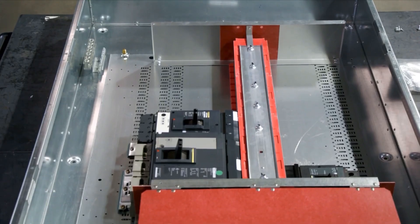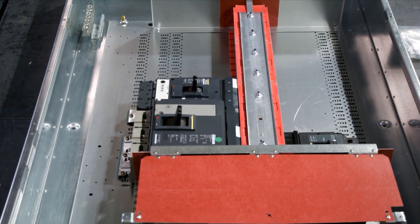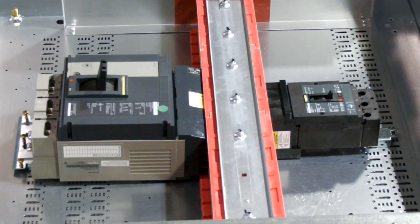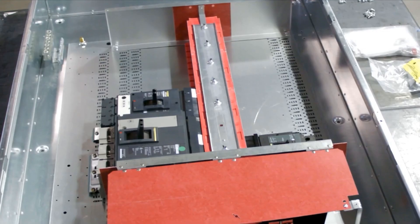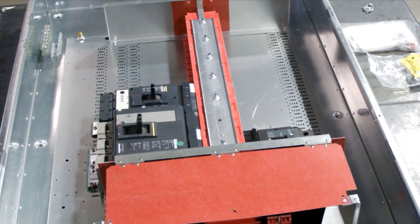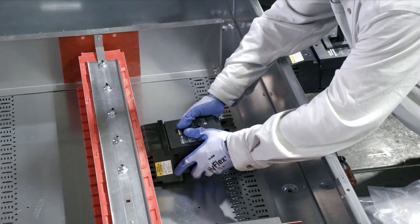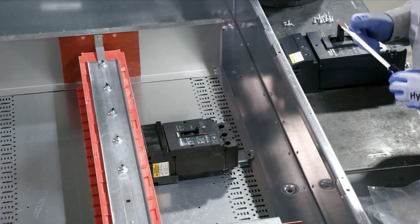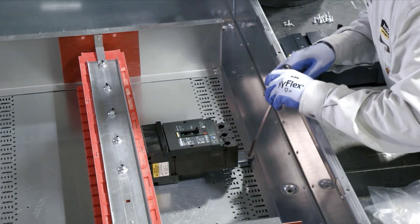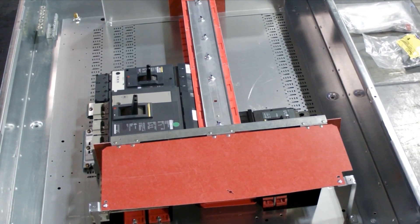What's unique about this I-Line circuit breaker system is its ability to allow dissimilar circuit breakers to be mounted across from one another. For the first time, you can actually mount a 1200 amp circuit breaker across from a 15 amp. This innovative game changer gives you unprecedented flexibility in a panel board, allowing last minute changes and adaptations since circuit breakers can be installed quickly and easily. And unlike other panel boards that cut off the space in the panel, I-Line lets you add breakers as needed down the road. Simply buy I-Line in mounting inches and there will always be inches left over.